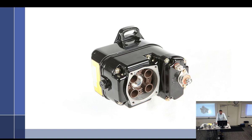Moving parts, points, condensers, points arc. So you have the overhaul periods. With the electronic ignition, you can program it to do spark advance. I'm a little out on this one, because if you take off one of your mags and you put on an electronic and you do the setup that allows it to do spark advance, it's going to fire before this one. So this one's now going to be a little late, and so you're really only running on one set of spark plugs, which the engine wasn't designed to do. They designed it to fire at the same time and figure the flame front. So I'm a little out on that one. And knowing too, when you shut off one magneto, all your EGTs go up.